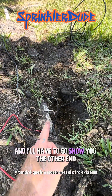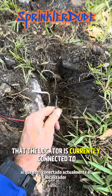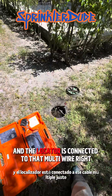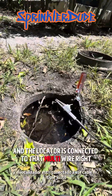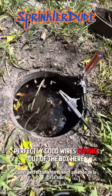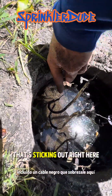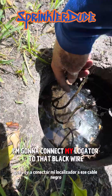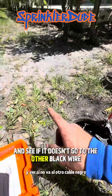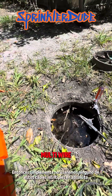One thing I know — and I'll show you the other end — is that the wire the locator is currently connected to is sending power to this wire here, and the locator is connected to that multi-strand wire. When we have perfectly good wires coming out of the box including a black wire sticking out right here, I'm going to connect my locator to that black wire and see if it goes to the other black wire down there. Then we'll just not use any of this multi-strand wire at all.